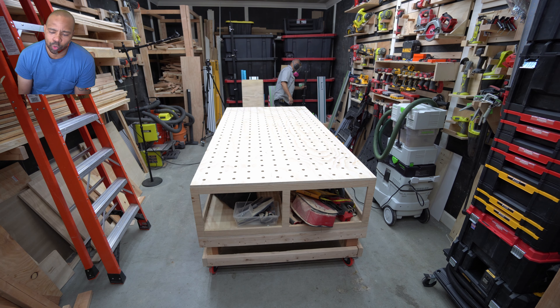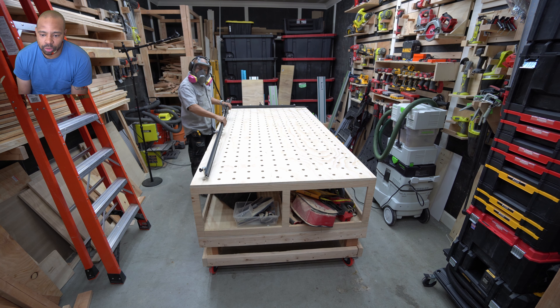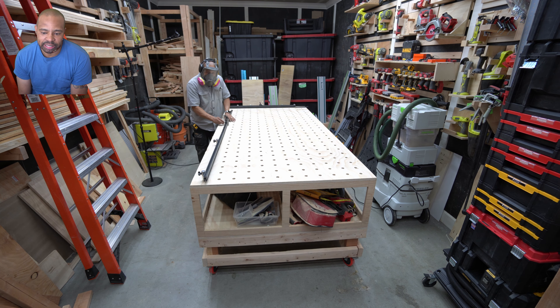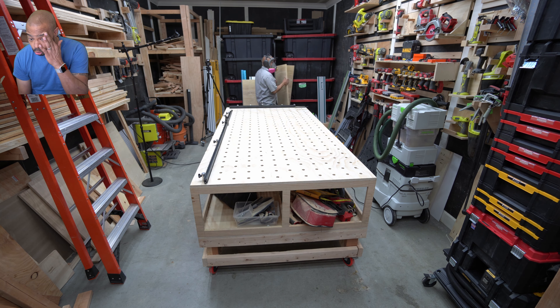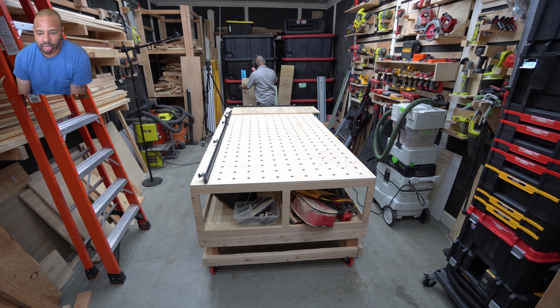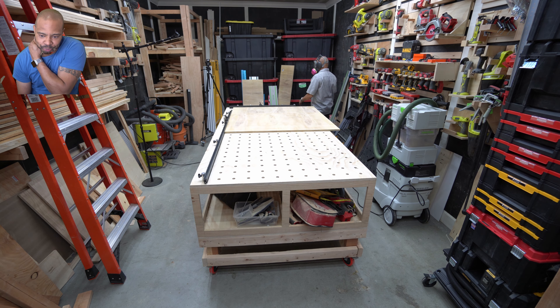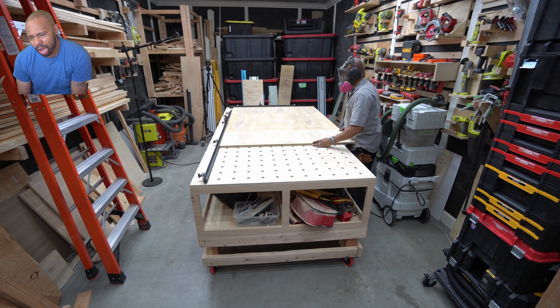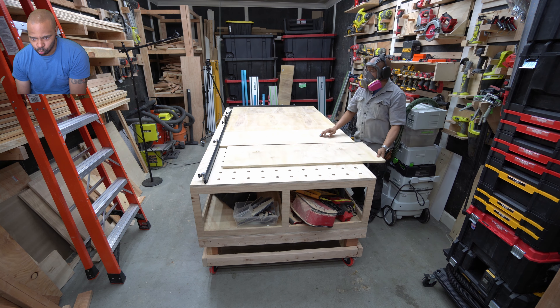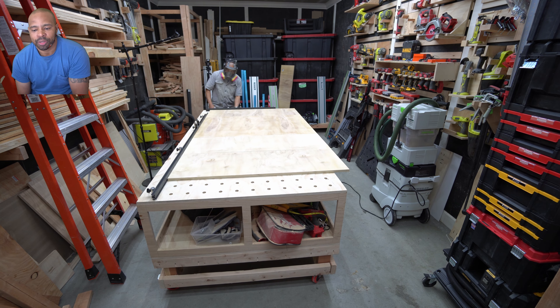Now that I'm finished making those basic cuts, I get rid of my foam mat that I use to cut into so I don't destroy my top. This is where I realized my mistake — I'm trying to use both of my bench dog fences to wedge all my pieces together so I can do a dado across all of them. However, I'll figure out that I'm going to have to go through the rail or I won't be able to complete the routing. Also, with the table being so wide, I'd probably have to be up on top of it to make some of the dado cuts.